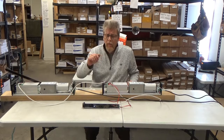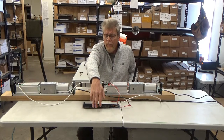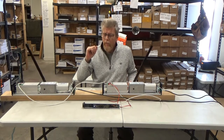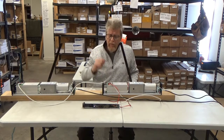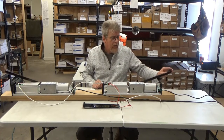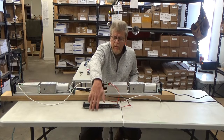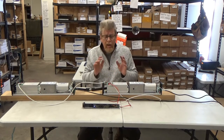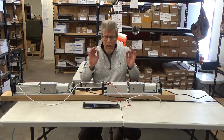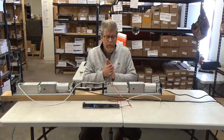We're opening now — it's not going to do anything while they're opening, but if we're closing, we can trigger and they'll open back up so grandma gets out the door. I really like the way we got this set up. It will not trigger them open in this configuration; it can also be set to trigger open and back the doors up, which might be good for a pet, but sometimes you just don't want that scenario.